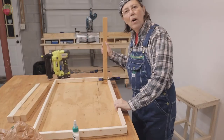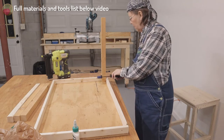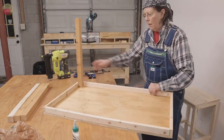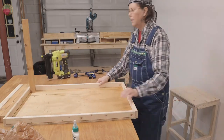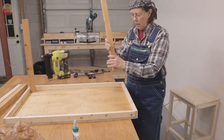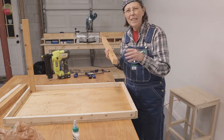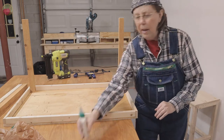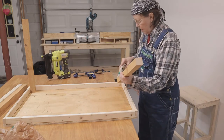I've got one leg mounted here — I'm going to show you how I did this. We're just going to go around in a circle to do all of them. Flip this around this way. Now, you can glue up on two sides for sure where it's going to meet. You can try the end grain, but end grain doesn't glue so well. But we're going to try that anyway — it doesn't hurt to go ahead and put a little glue on it. So I'm going to do this side.